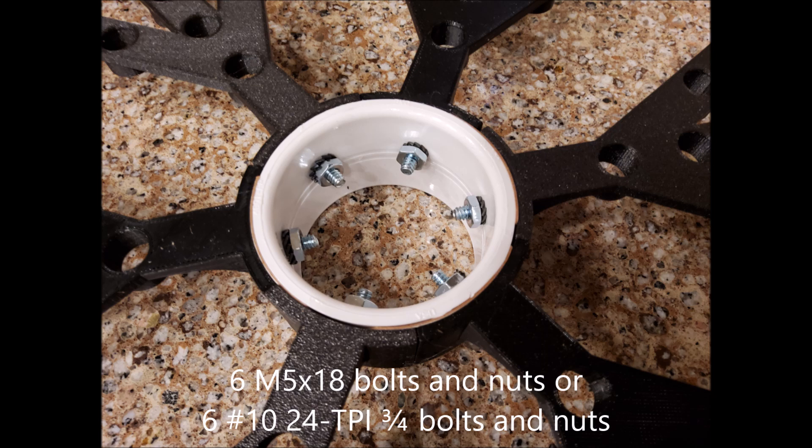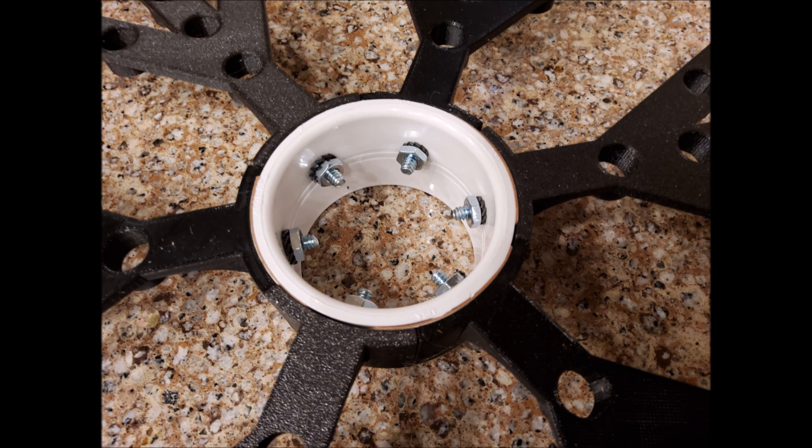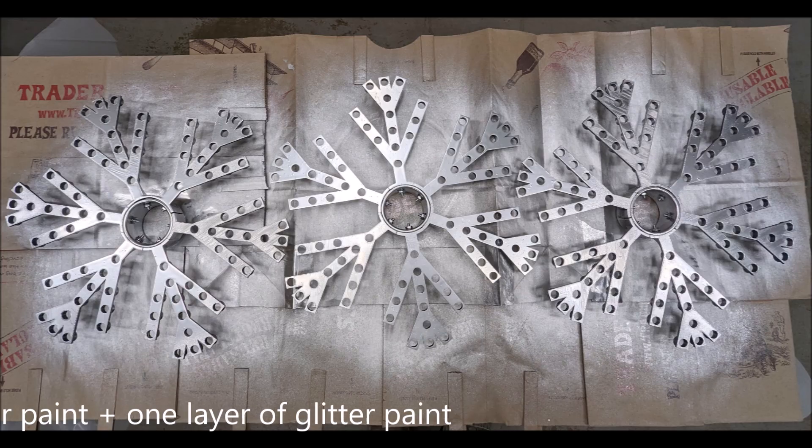I added a grover washer for good measure because I wanted the assembly to be strong. I also added a small layer of cardboard on my PVC pipe — that's what you see in the pictures — because it was not exactly fitting. My 70 millimeter PVC pipe was not actually 70 millimeters; it was 71 or 69, which is a problem you sometimes encounter at the hardware store.